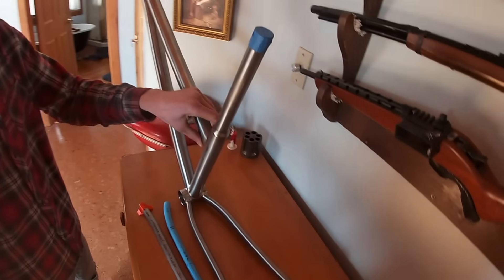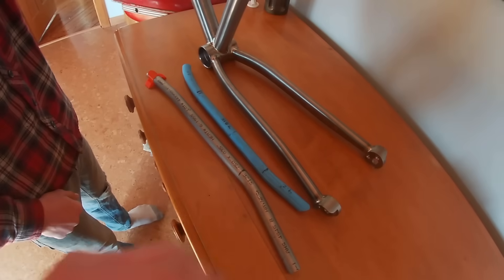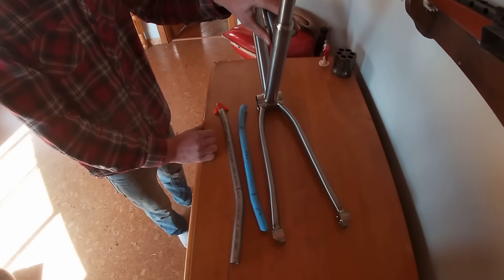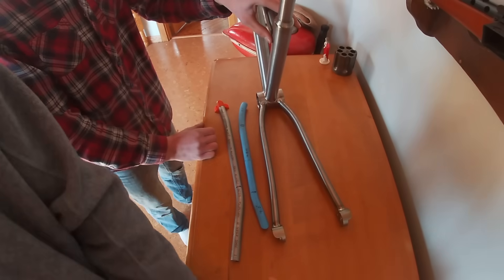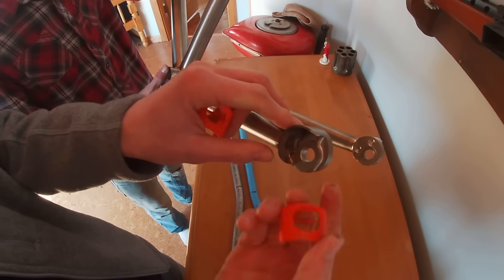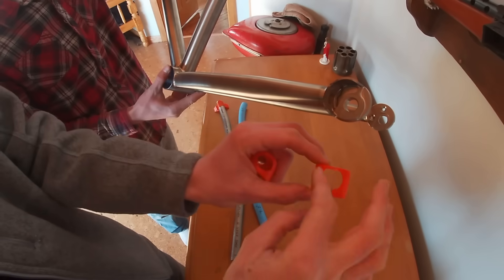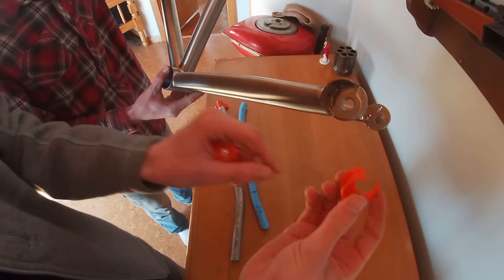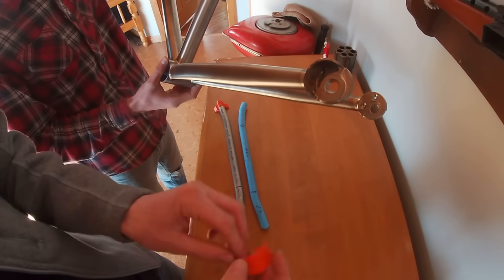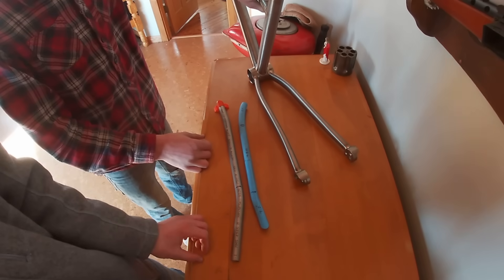Here's another update. We've just finished welding on the stays here, as you can see. Next, we'll be doing the seatstays. Also, we're going to talk about how we did the mitering. We used these 3D printed pieces — they're supposed to imitate the dropouts here. They've got a cutout, similar to this, and then they've got the cutout for where the stay will end up. So we can stick the stay through here and then scribe it, which gives us the line we can work off of for the filing. It works pretty well — that's what we've been doing for every one of the joints.